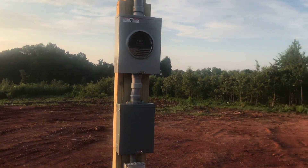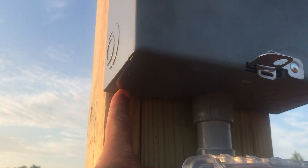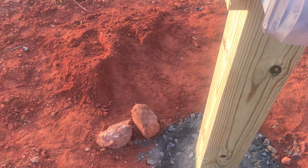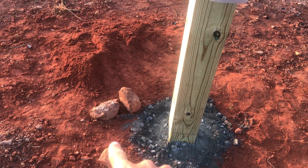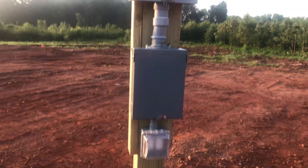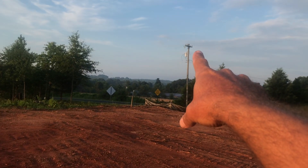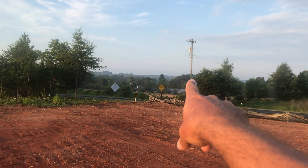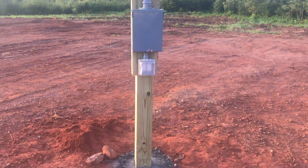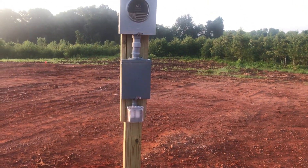The other thing I need to do is underneath here I need to knock out a hole and run my ground wire down. I've got to get my copper rod put in the ground. That's going to be today's project along with the leg bracing. We're going to have two braces — two legs come out to the side here to help hold the pole, since the wire is going to be pulling the top of the pole. We need additional bracing per Duke Energy requirements. Hopefully it'll be a short day — I'm hoping to be done by noon and before the weather moves in.